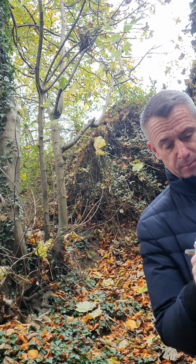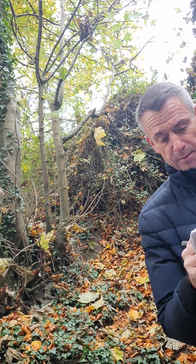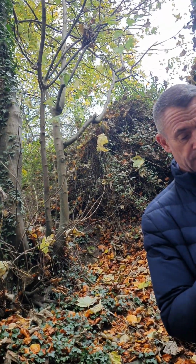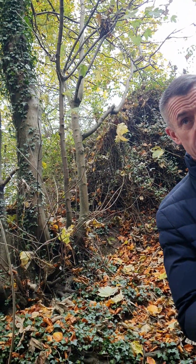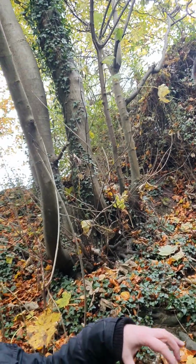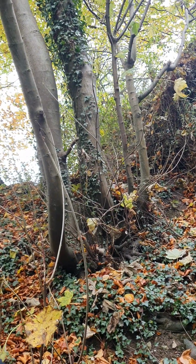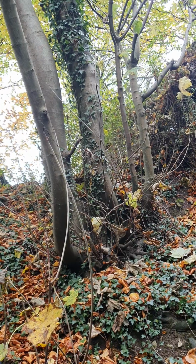Theoretically, for a bridge, it's almost like a category 2 check where somebody else just checks it anyway. Yeah, absolutely. So maybe that's the process, and I'm absolutely happy with that. So he's asking, will DGH need to rely on the EPS survey? What does that mean? EPS are the site investigation that's been done, so the ground investigation. Right. EPS have done some window samples either side, and I think that should be sufficient because we're not piling or anything like that.